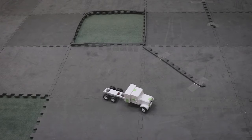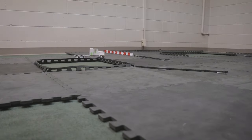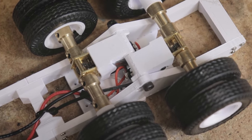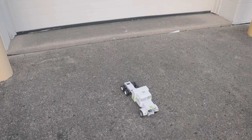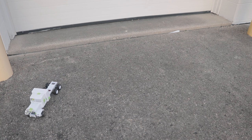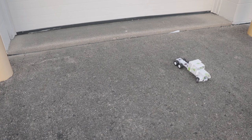I've done quite a bit of driving with this truck and, despite not yet having a trailer, I've haphazardly towed around some weight just to see what it can do and ensure it'll have plenty of power to tow around the lightweight plastic model kit trailers. These N20 motors are sufficient especially on 3S, but they do lack a bit of torque. When choosing a motor I'd suggest going with lower speed variants that provide more torque if you plan to drive only at slower speeds like moving trailers around a loading dock. The steering angle is pretty good — it's quite maneuverable even with this long wheelbase. If you notice the servo twitching, I dropped this chassis and the steering servo got a bit messed up, so pro tip: don't drop your chassis on concrete.